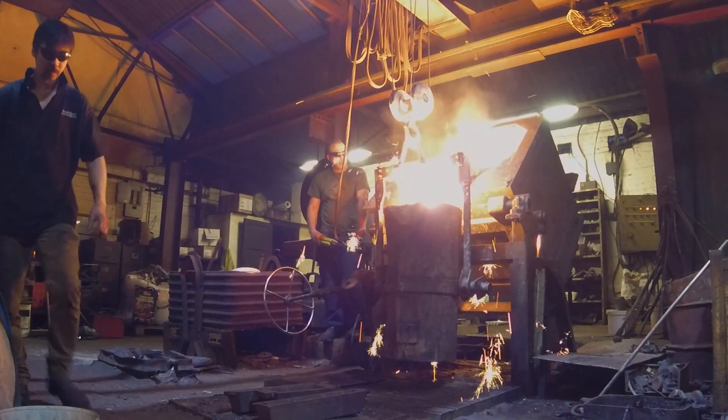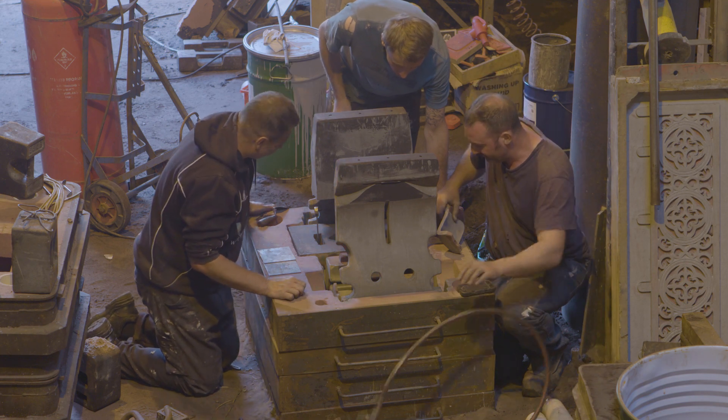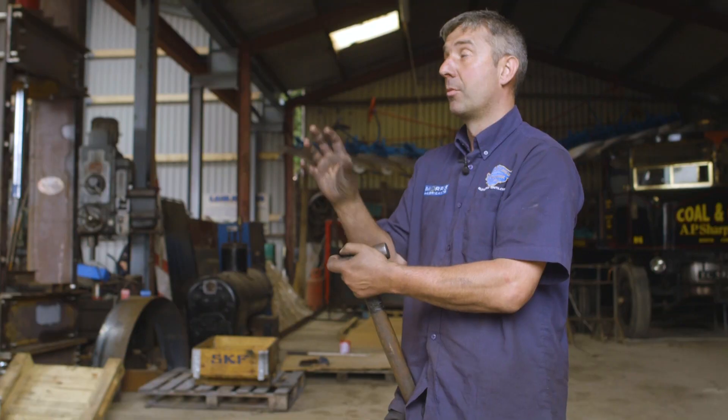A difficult process, as Alex found out. So once it was cast, the next job is to machine it. You set to working from the drawings, bolt it to a big boring machine and set off, put a flat face on it and then work from that to make sure everything is parallel. And there's literally hundreds of hours of machining in that to get it right. It's quite a critical part of the engine — if that wasn't right, everything else would be wrong. But successful with that.